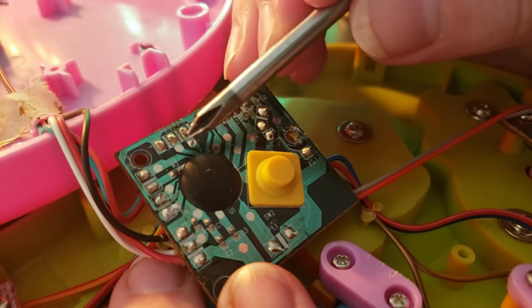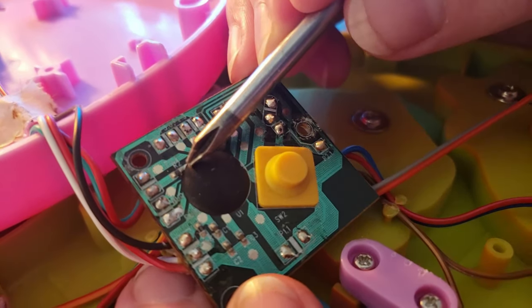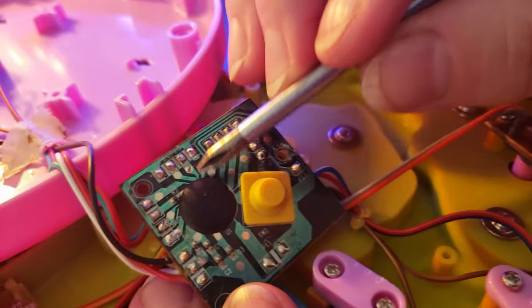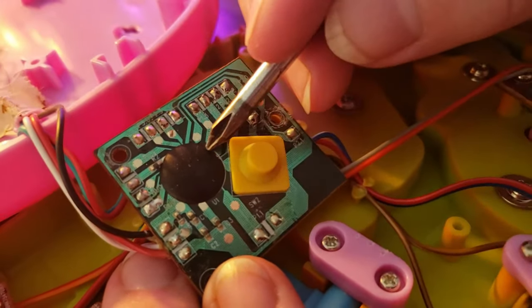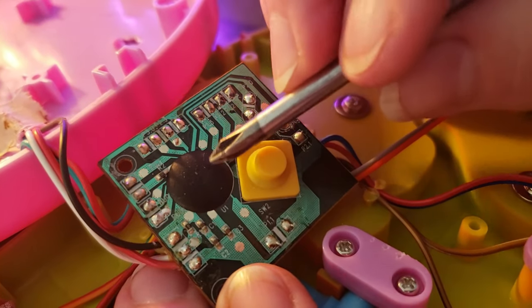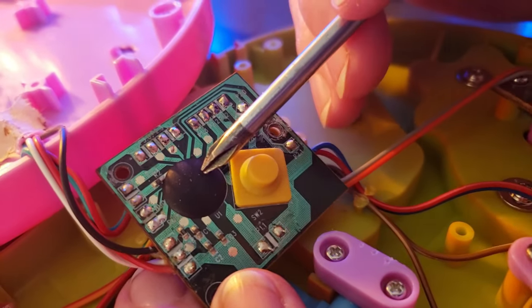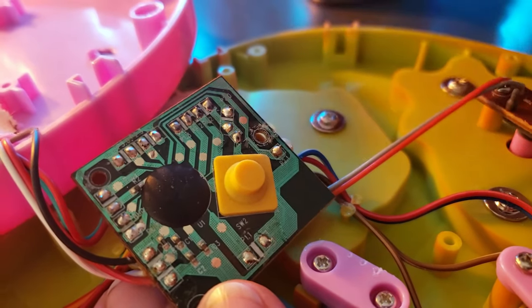So we've isolated our resistor, and it's going to be this one right here. But as you can see, this resistor does not have much room whatsoever when it comes to this integrated circuit right here. Now we can't remove this goop that they put over it, because it will come up with the integrated circuit if we pull it up. What companies often do is put this over their integrated circuit so other companies can't steal their technologies. And in this case, it's a toy.